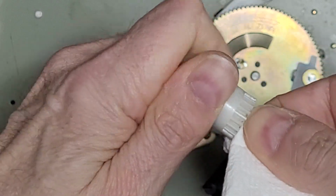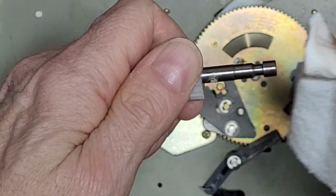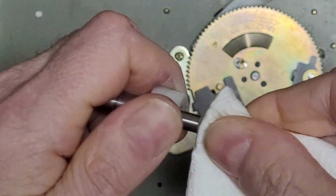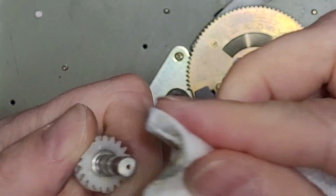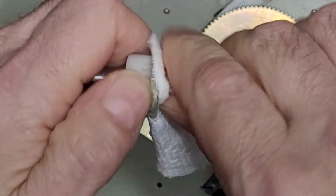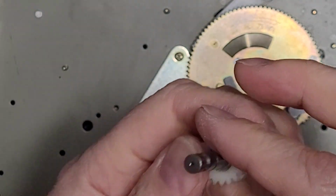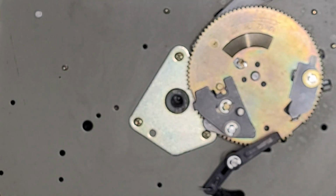I've replaced all the components on the power supply board, and there's no change. And when I went to measure the coils in the motor, one side is super high resistance. So we got a bad motor, and that's unfortunate. So they do go bad. You don't see it very often in these. These are pretty bulletproof, but I have heard about those system decks and bad motors. Usually they say it's a phase capacitor, but I changed that. Changed the resistor, and no go. So unfortunately that one's got a bad motor and there's nothing I can do about it.